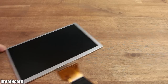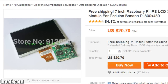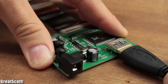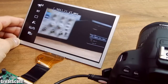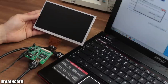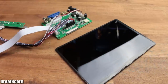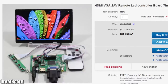Initially I wanted to use a very cheap 7-inch 800x480 LCD display, but the driver board is not capable of displaying true 1080p properly — it just shows one quarter of the picture from my camera. With low resolution it kind of works, but I'll surely find another project for it. I still needed a screen for my Canon, so I found a more expensive 7-inch display with a resolution of 1280x800.